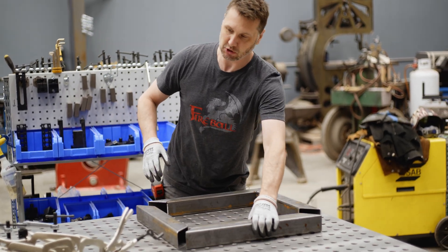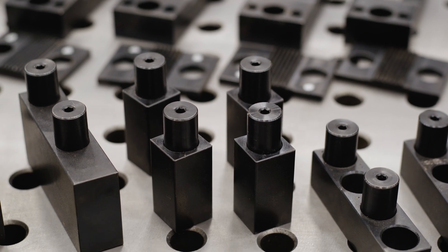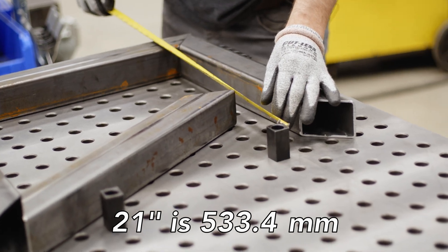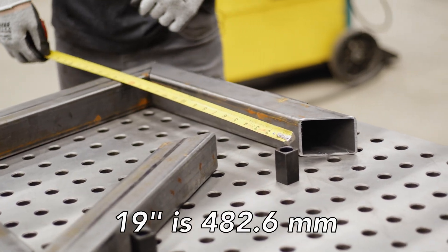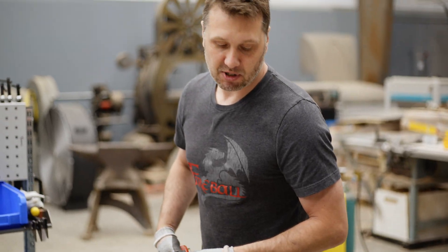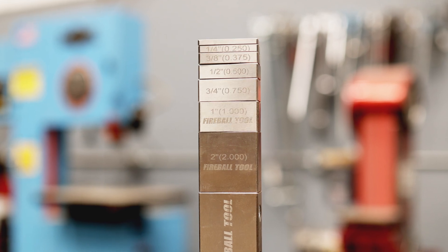So what do we have to choose from? If I put another block down with these pins, it's not going to position it in the right spot. That's going to give me a 21, and if I move that pin in here, that's going to give me a 19. No matter what hole I choose, it's in the wrong spot. So I have a couple of options: shims to space this dimension out, or I could use what I call the tooth block — an adjustable stop.